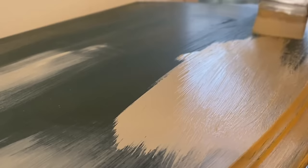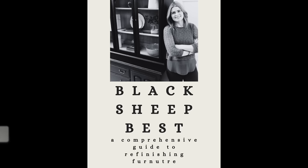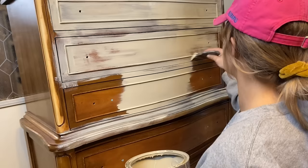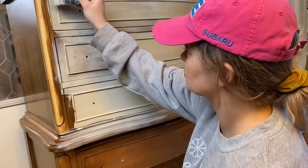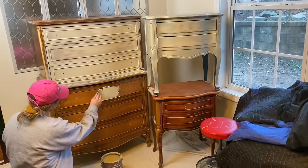The first thing I did was clean the pieces really well, do a little scuff sanding, and a little clear shellacking over any raw wood parts — the beginner stuff. The paint I'm using is Benjamin Moore Advanced in the color Bar Harbor Gray. You could use any light tan, a pinkish tan for a pinkish undertone, or a more neutral color. In this four-part series we'll talk about all the different undertones and which paints to use depending on your floor and room color.